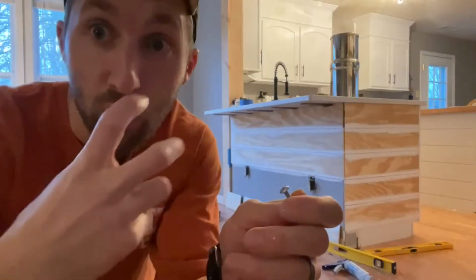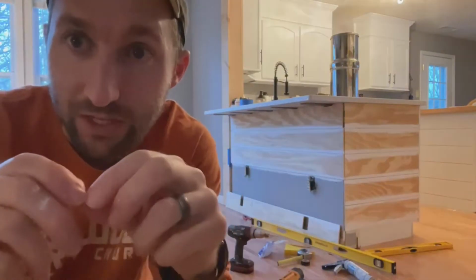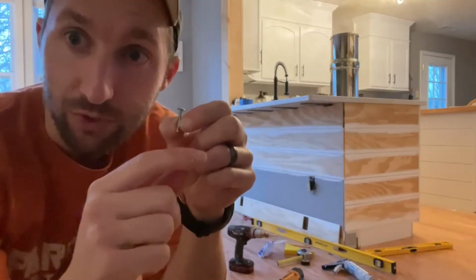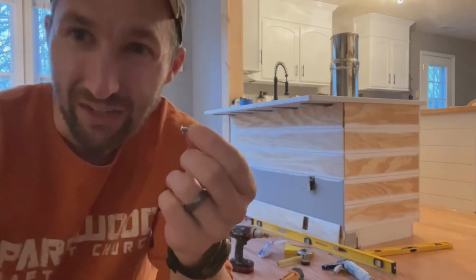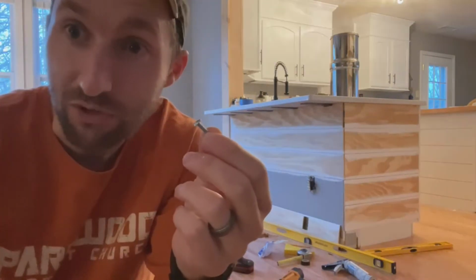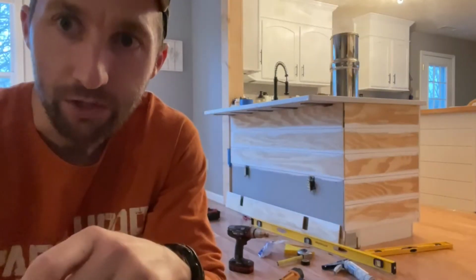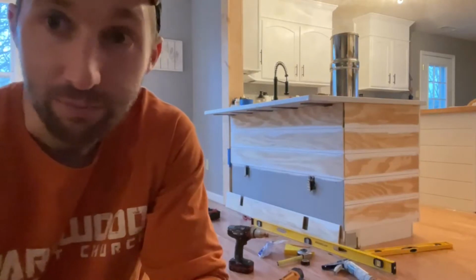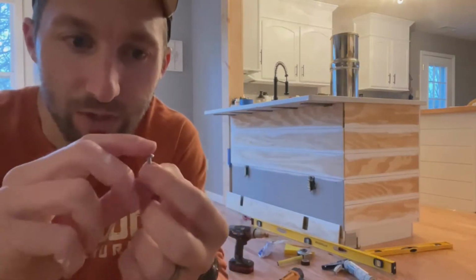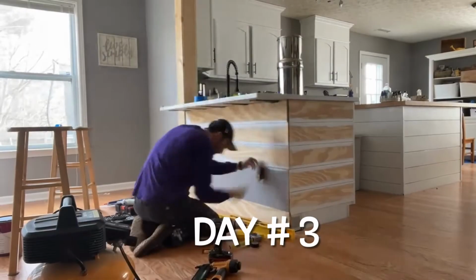So when you pull outlets out, you have to get extension screws. These just aren't long enough to reach the place where it's screwed into once I put them on the outside of the shiplap. The last time I just found a bunch of random screws, and I've done it so many times now, I'm totally out of any type of long skinny screw. So gotta run and go get them. Good news is I gotta use them anyways once we tile the kitchen for the backsplash. So something as small as that will derail the project. I'll need to get one about that long.